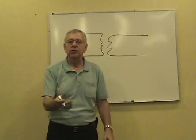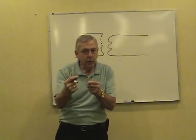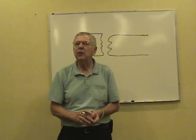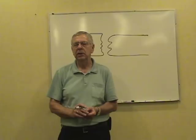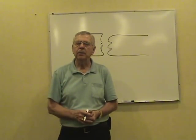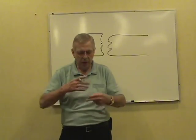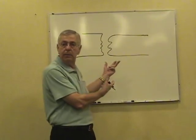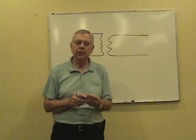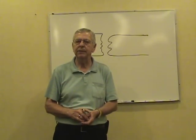On an exam question, you always assume a transformer is 100% efficient, unless in that question they tell you differently. If they tell you differently, then you deal with it. And transformers are real high in efficiency. You know, we did motor efficiency back in the motor video. I don't know, it's, what was it, 60-something percent efficient? Motors have a lot of moving parts. Transformers don't have moving parts. They're real high in efficiency. American Electrician's Handbook says they're 96, 97, 98, even as high as 99% efficient.